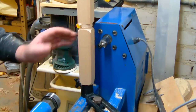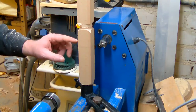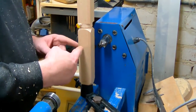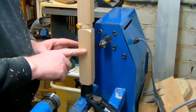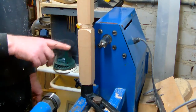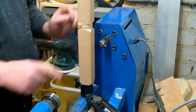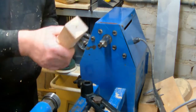It will stay pretty stable at this position. What I'm going to do now is drill an 8mm and a 10mm hole through the center line — the height of the center line — and then I can use that to drill straight through up to the center of the turned piece. And that's what I wanted. So let's get over to the drill press.